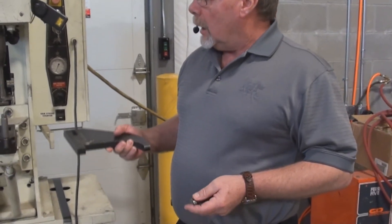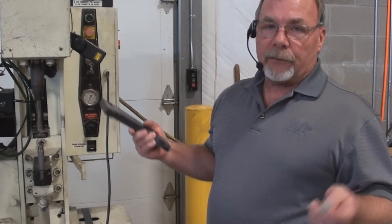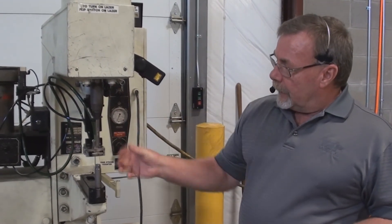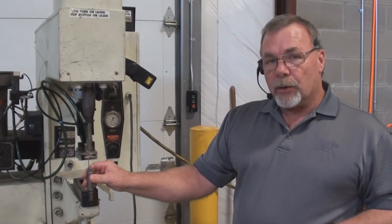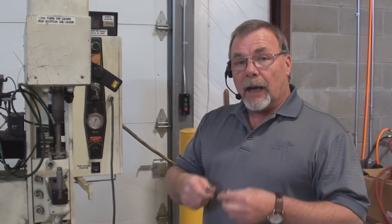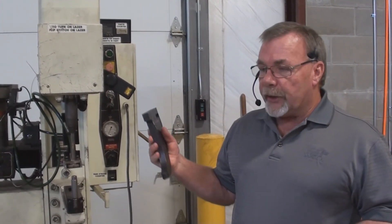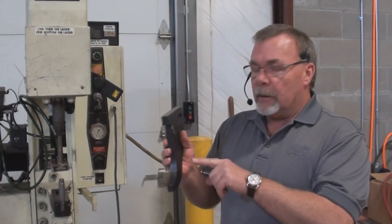The Haeger Press can also be used in a manual mode. There's a full complement of tooling available, whether inch or metric, to allow you to install all different sizes of fasteners. All we need to do is remove the J-frame — that will take all of the shuttle tooling out — then replace the upper vacuum tool and the lower tool with one of any length that gives you access to your part, with the upper tool typically being a flat anvil. They also have what they call a J-hook, which will allow you to get into parts with a return flange — so if you need to put a nut on the bottom side of a return flange, this will allow you to do it.